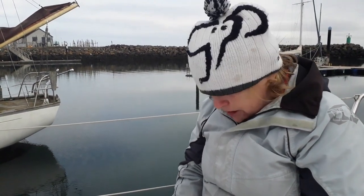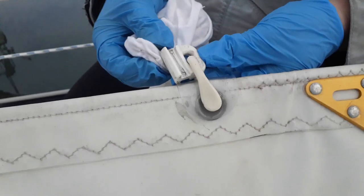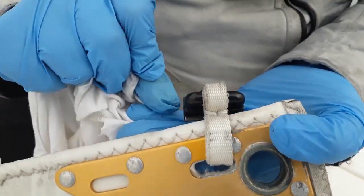Since the sail is just about to go up, I'm cleaning the slugs. I can tell they've already got two different types of slugs — these white ones, which are just plastic, and this black one, which has actually got metal on the inside. Why are you cleaning them? Well, we're going to be putting up the mast and it's just part of our annual checks, making sure everything slides properly. We're going to be coating them in PTFE. Try to put PTFE up the track as far as you can, but failing that, at least put it on the slugs — it just makes the sliding that little bit easier.